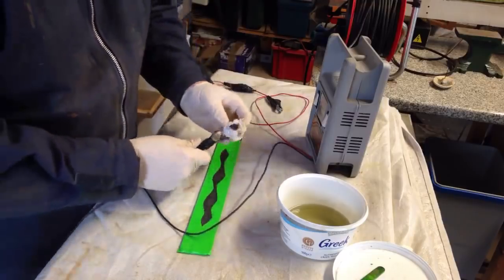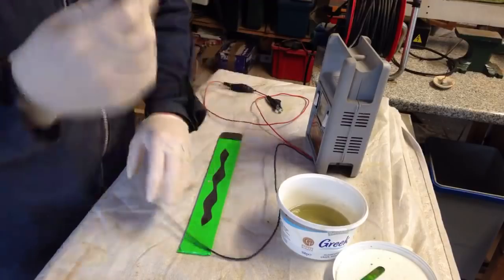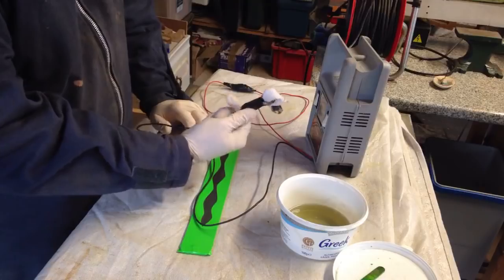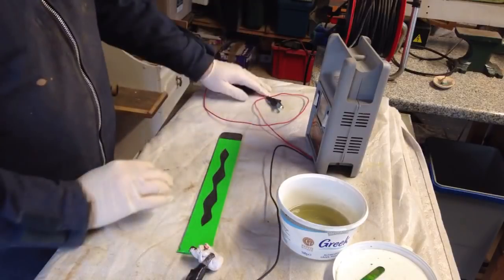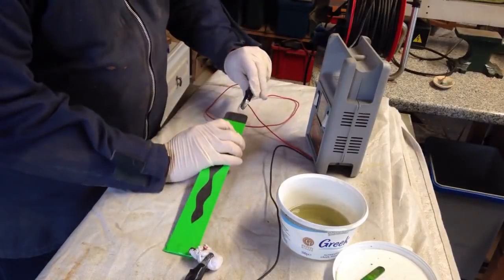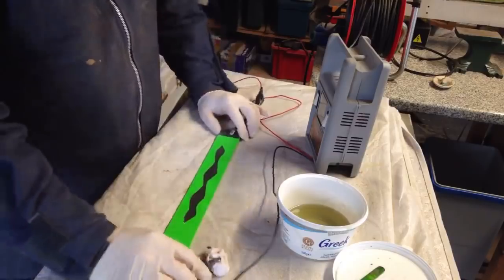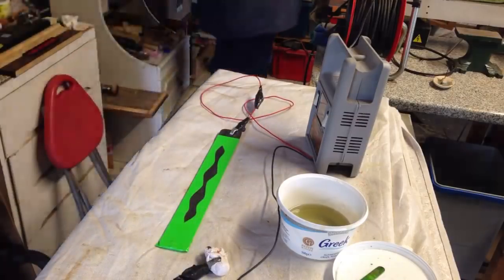What I'm going to do now is clamp the negative to the bolt with the old dishcloth around it, and then double-check that's the positive and connect the positive to the work piece. Everything's going great so far. I'll take these latex gloves off and get some tissue paper. I hope you're following me — we've got a piece of steel that we've cleaned, made a duct tape design on there, and obviously where the duct tape is won't be affected but the bare steel is going to be etched permanently.